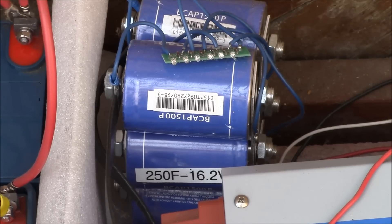Combining small and deep cycle, my bank does not deliver high surge current without a high voltage drop, so the inverter used to complain about low voltage and sometimes shut off. Now I could go out and buy bigger batteries, and eventually I'll do that, but I wanted to try out a supercapacitor and see what it would do. I thought it might kick in a few seconds of surge current and that might do the trick. So I did some testing with a clamp-on ammeter and the inverter ammeter and saw inrush currents in the 140 to 160 amp range.